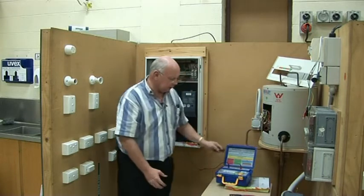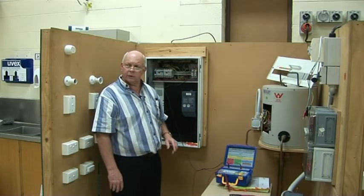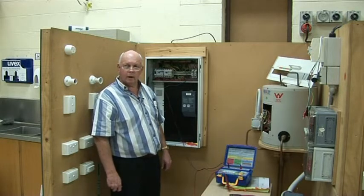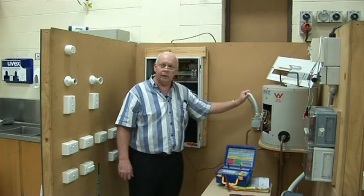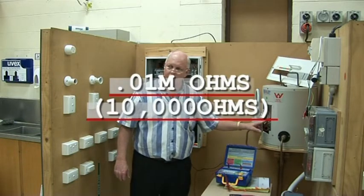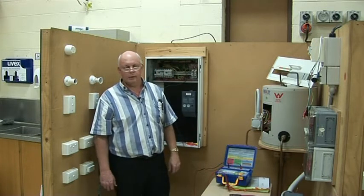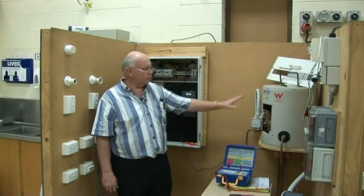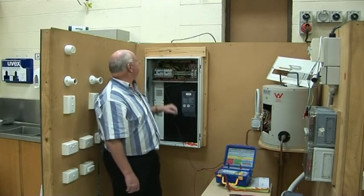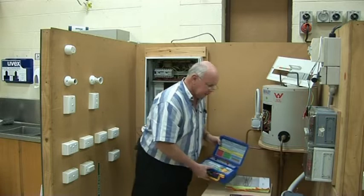So we've operated our two-way light circuit. If I got a reading lower than one meg, what could possibly be causing a problem? Hot water. What do we do about it? We're going to disconnect it at the hot water, because the cable going to the hot water needs to be greater than one mega ohm. It's only the element that's allowed to be 0.01 mega ohms. The cables are a separate issue and they need to be one meg or greater. You need to tell us you've disconnected at the correct place at the hot water. That pretty much does the insulation test.